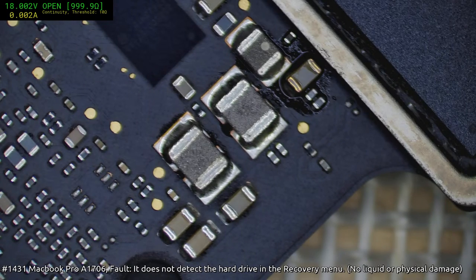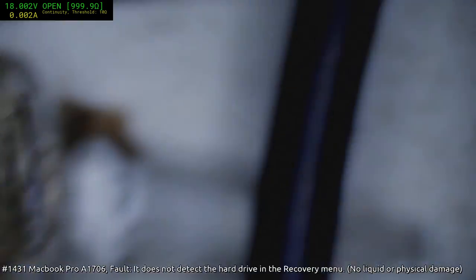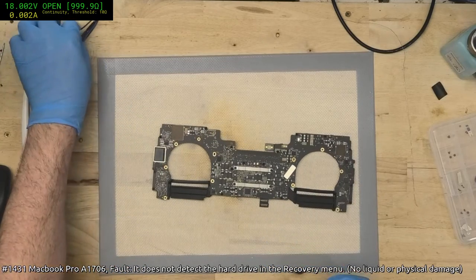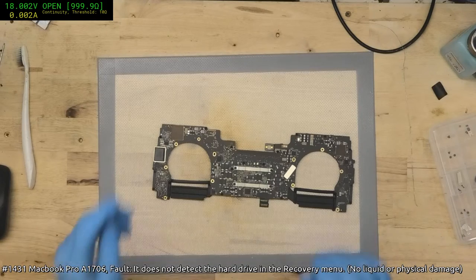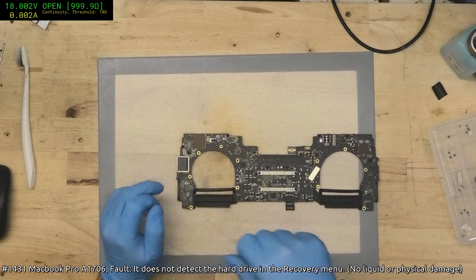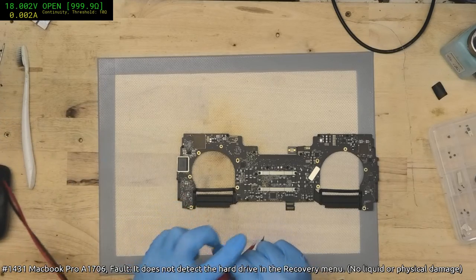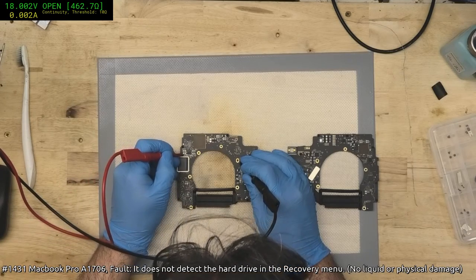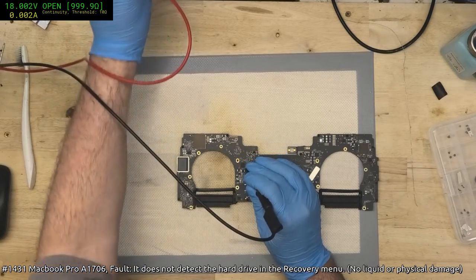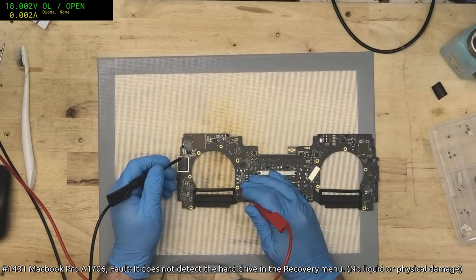Anthony, no, this is an entirely different machine. This is a 1706. Now, the other thing is, I really do need to fix up that cap by the CD3215, because that is a well-known failure point. So there's no point just packing this up and saying fixed, when I know that that one's going to pop and die within the next month or two. It's a bit of preventative maintenance.